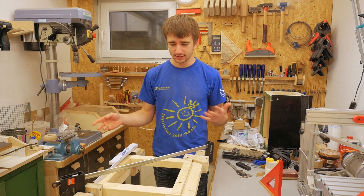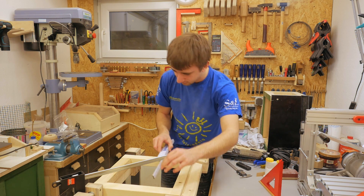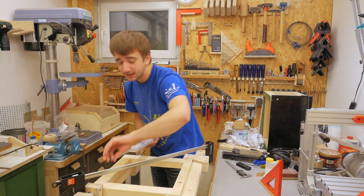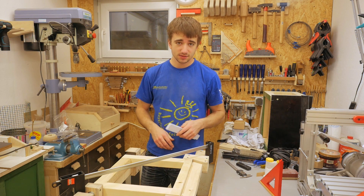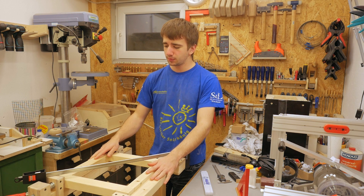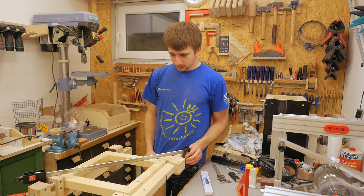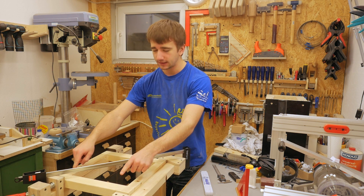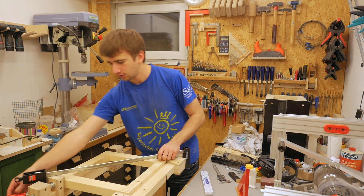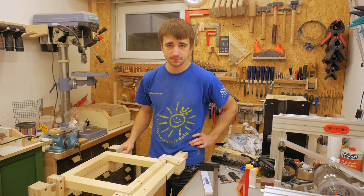That's just illogical, that can't be. So I measured the distances inside and got 25.5 here and 25.8 there — and that's the problem. It's even worse noticing this during glue-up when you've already put clamps on and the glue has set for about five minutes. So I made sure I had two corners square and just let it dry like that. Well, shit happens — let's fix it.